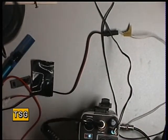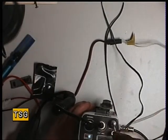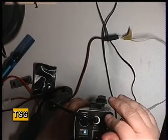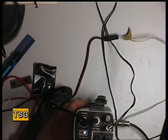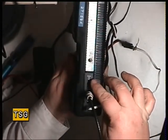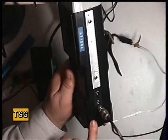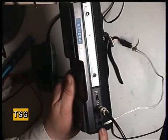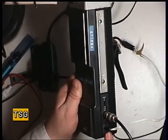We've got this on an external microphone so we can set it up with the test setup. You do have the normal telescopic aerial which is one and a half meters in length. We've plugged into the external speaker socket for the test instruments. There's squelch and volume, relative RF output, and the channel selector. On the side, high-low power which is 4 watts. External antenna which we're plugged into the test set. Charger socket which is a 2.1mm power connector and we're plugged into the power supply.